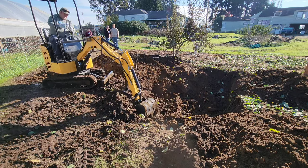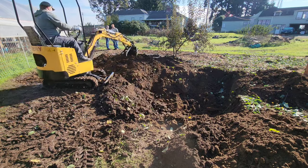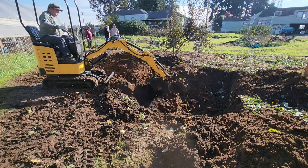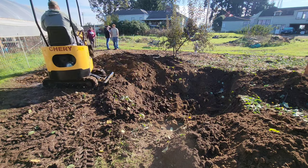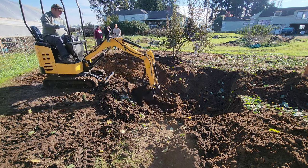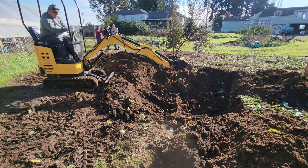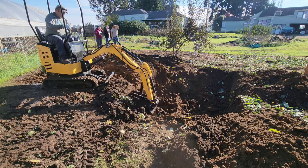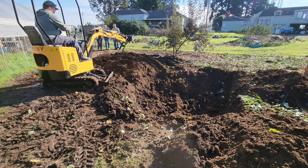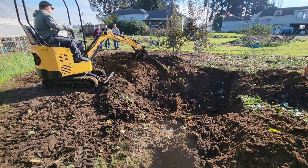People aren't doing the oil changes, or they're not checking to make sure that they have oil. There's a combination of an oil check and an oil fill hole, so the dipstick's built into the cap. And if one of those rattles loose, because it's a small motor and makes a lot of vibration, you could lose your oil out of it and seize up your motor. So check your oil fill caps, make sure they're tight, and make sure there's oil in there. That simple maintenance process gets overlooked, and people seize up a motor.